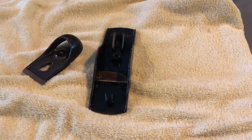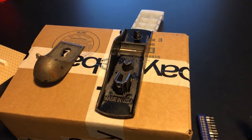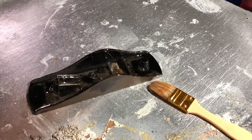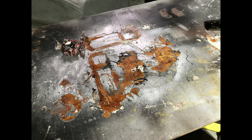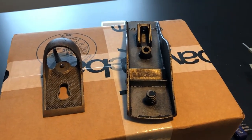Here are the pieces after the first application of Citrus Strip. It probably removed less than 10% of the paint originally on there, but now that we've scratched all the paint with the wire brush, the second application should work a lot better. Here are the pieces after the second application — the piece on the left is basically done, but the piece on the right still needs more. For the third application, I wanted to show how strong this stuff really is: I used a piece of wood that I spray paint everything on, which has many many layers of paint, and Citrus Strip brought it down to bare wood again. I decided to scrape off all the loose paint with a putty knife and you can see the outline of all the pieces we were working with. I'm completely done paint stripping now — I could do a fourth coat on the right piece, but on the next step where I remove rust with a wire wheel, I should be able to get the rest of the paint off that way.